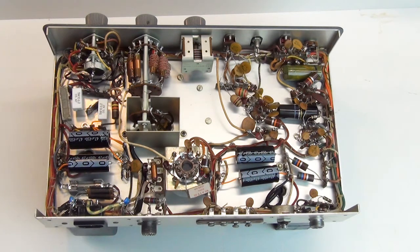At this point I've completed all of the repairs to the power supply. What I like to do on these radio repairs is pause and proceed to test the power supply at this point. That way I know it's working and there aren't any other issues in that part of the circuit before I spend any more time and money repairing the rest of the radio.